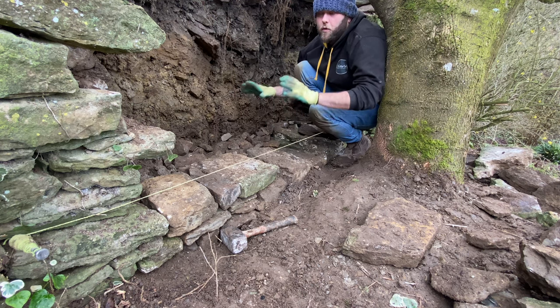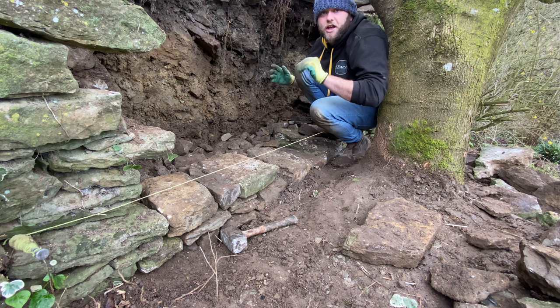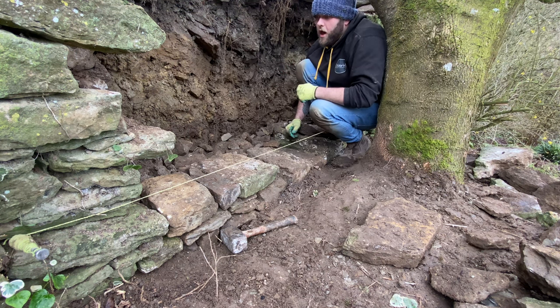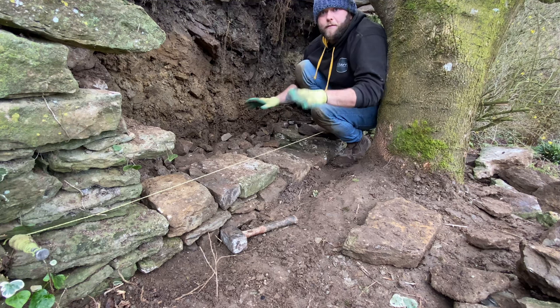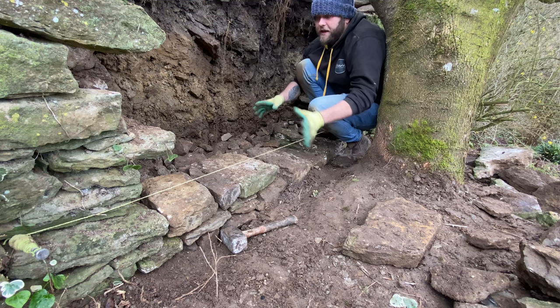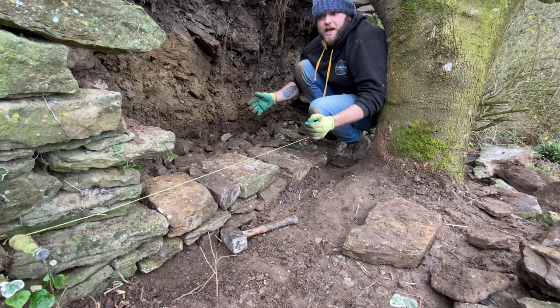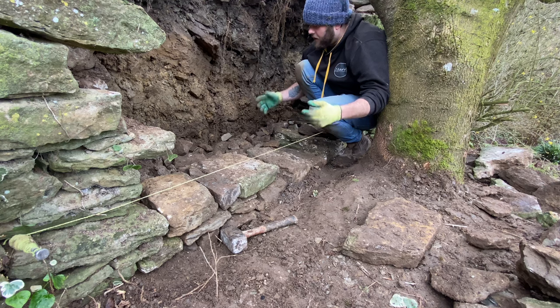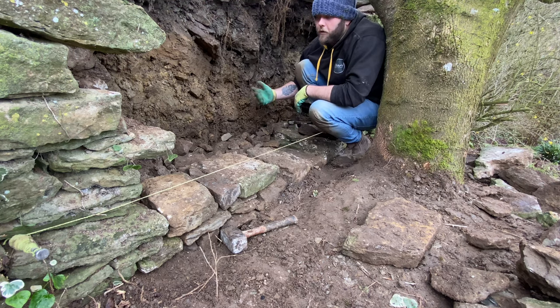Like I say, it's quite hard doing repairs because obviously you are knitting in to other bits of wall, and as you can see on this one, quite damaged bits of wall. But at the end of the day, as long as you keep the main factors of big stones, tail stones in, nice tightly packed and hearted, just those simple factors really, you'll get on fine with dry stone.